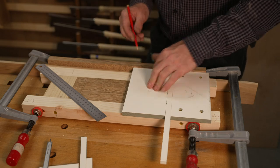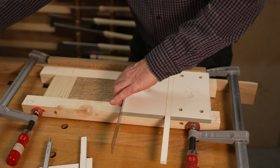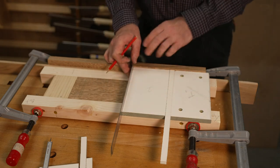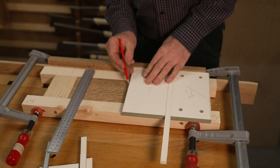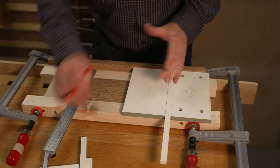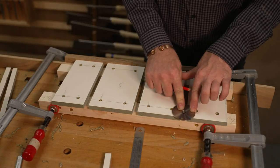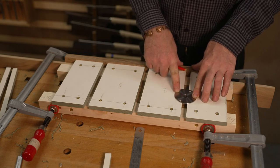So if we put that in, we are now the width of our two rulers for that joint. So we're just pushing over that little bit. So using that ruler can be a good double check just on where we are. So we're slightly short. So when we use the guide bush, it will centralise it. So it's that working out that little bit of offset, and the ruler way can be a good way around that. So at this point, we know that our guide bush will fit into here and we can move it along. But we don't want to come all the way off the end.